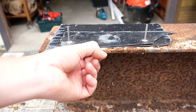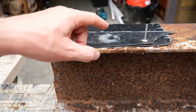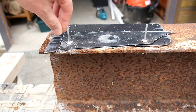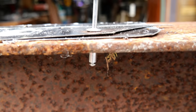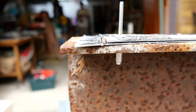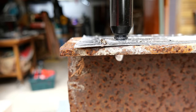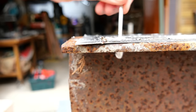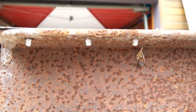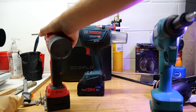Milwaukee — pretty quick. Makita — no problem for any of the tools as you would expect. Next, time to rivet some rubbish: this is measuring 7 millimeters thick on my calipers but I'm guessing it's a quarter of an inch with the rest being rust. We've got a couple of half-mil sheets of tin and a bit of swarf stuck between. We'll see how well these can pull up. First the Milwaukee, then the Bosch, then the Makita — three popped rivets. The Makita mandrel is the thinnest, the Milwaukee is the longest, and the Bosch is the fattest.